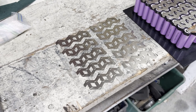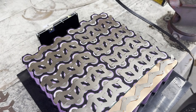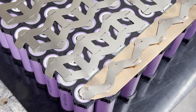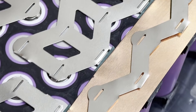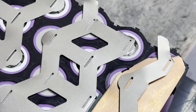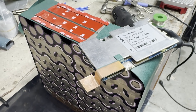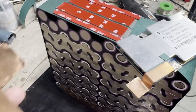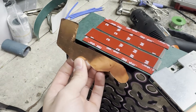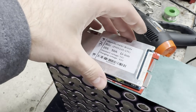Here's what the cell connections look like. I only need 0.15mm nickel since these aren't high current cells. However, on the bottom row I'm going to have to do a copper-nickel sandwich for the bus bar. I made sure to add some fish paper so these cells don't short out. After getting all that spot welding done, it was time to connect the BMS. I decided to do a little copper piece, and then another copper piece so I could put the BMS on top and then solder it on.